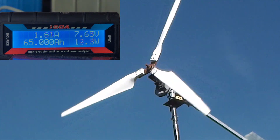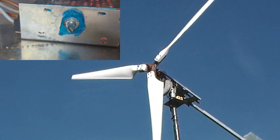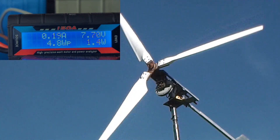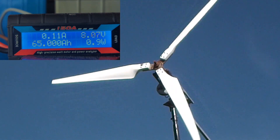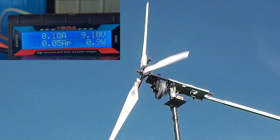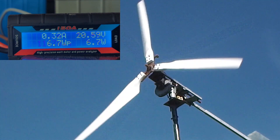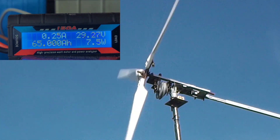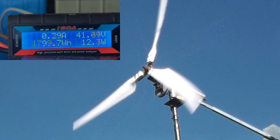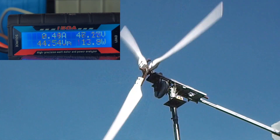You can see the turbine just can't spin fast enough under the full load unless it's very, very windy. Let's turn it to zero one more time — and you should see the speed pick up on the turbine. If we get a gust we'll let it go to its maximum open voltage and then we'll put the speed controller onto maximum. There's a bit of wind — she's picking up. All right, full.